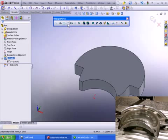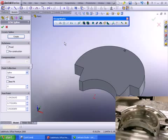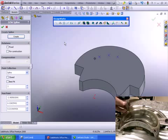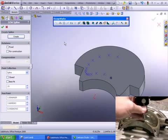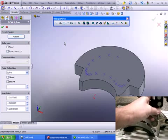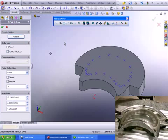We're going to go up and use the 3D tool in DesignWorks for a curve, and outline this top area. We can do this in manual mode or best fit — in this case, manual mode allows us to take the data where we want it. The flat ground area up here doesn't need a lot of data, but in this lower side we need a lot more. This gives the user full control. By pressing the button on the device I can take more data where I want, spreading it out in some areas. One of the key features of DesignWorks is the ability to work in a 3D sketch.